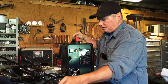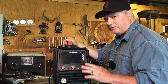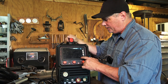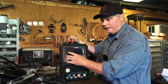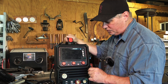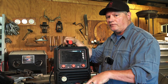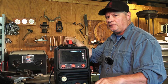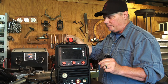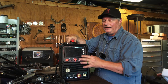Let's take a look at the front side. This machine has a seven-inch LCD screen. It also comes with a USB-C port for software updating — this test machine doesn't have it, but I could always upgrade this panel with the port. There's also your amperage control, smart settings, and that sort of thing. We'll cover that when we start using it. Our connections for our gun and our stick welding connections are here as well. So this is a double-pulse MIG machine, which should help in a variety of welding applications — thin material, very thin material, and different alloys — because it gives you a little more control of your heat.